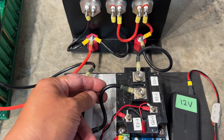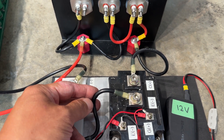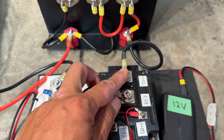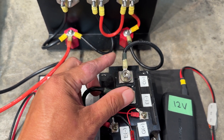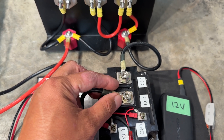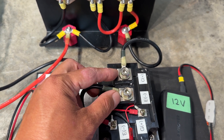All this wiring acts a little bit like a coil — it has some inductance, and what a coil wants to do is keep current the same. Similar to how a capacitor wants to keep voltage the same, an inductor keeps current the same. So if we have 100 amps flowing through here with the switch closed, when the switch opens, the inductance wants to keep 100 amps flowing. It will create a high voltage arc to try and maintain that current, and we can see that voltage spike on the oscilloscope.